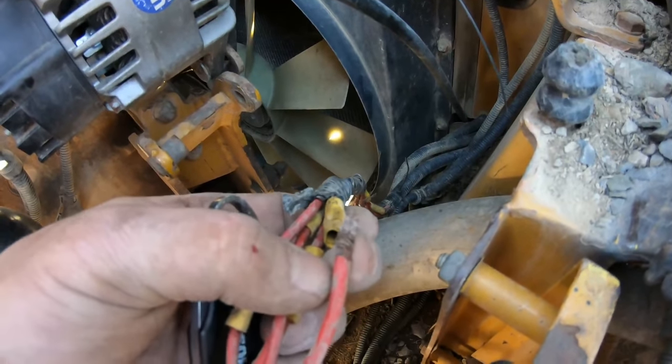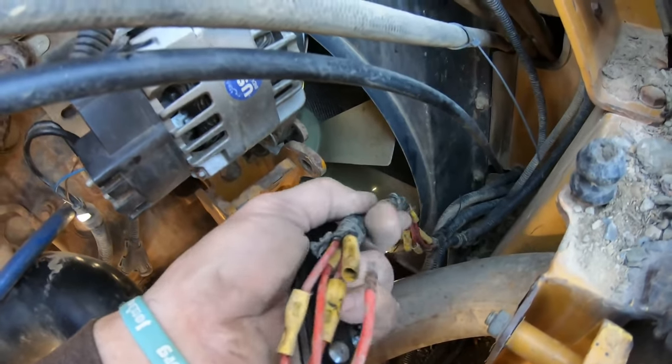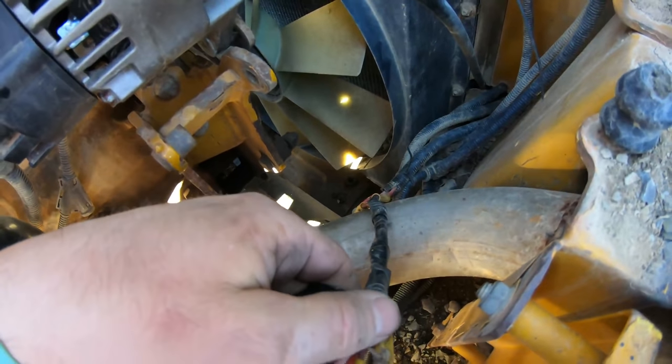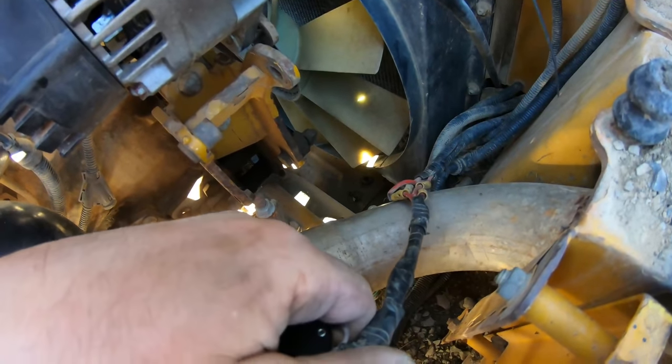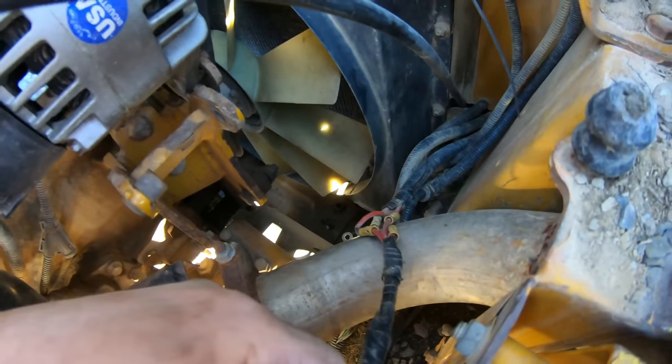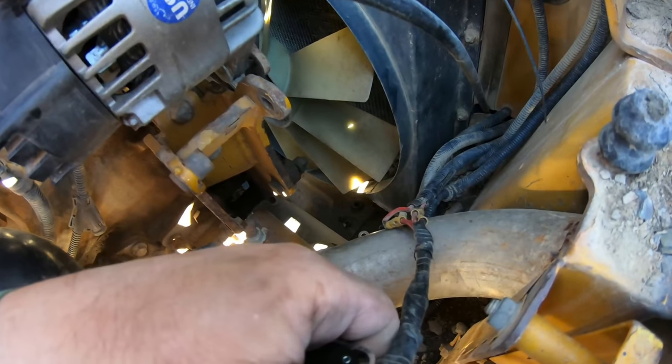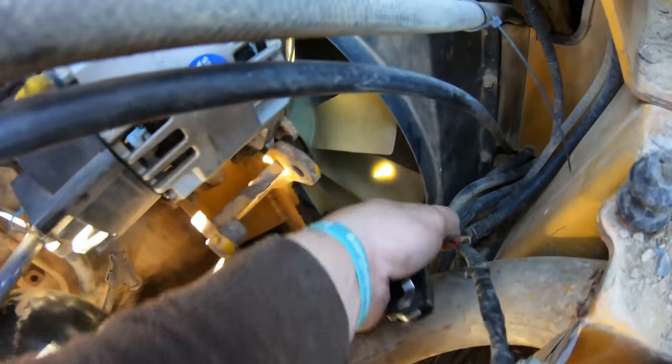But not to say that that wasn't connected. I tugged on it pretty good. But you look at these connections from there to there. So obviously it was in the span right where that muffler was, or the exhaust pipe coming out, and it burnt, and then they connected all new wires. And I'm assuming this is obviously where the problem lies.